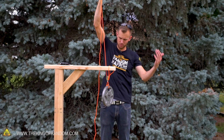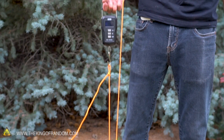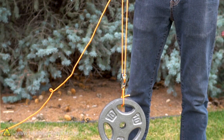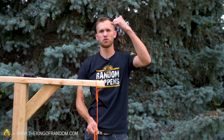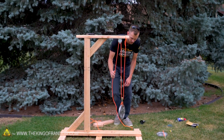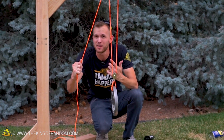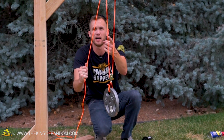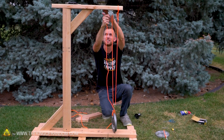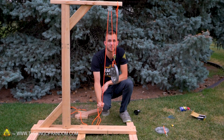There has to be a trade-off — you can't remove the amount of work it takes to get that weight up to its final height. To raise it all the way up, your hand has to travel twice the height of the weight. We're back to the issue of pulling up, which is not as easy a motion as pulling down. So we can run it through the fixed pulley again — now we can pull down and lift the weight up. The fixed pulley doesn't change the magnitude, but it does change the direction, so it still takes 5 pounds pulling down.